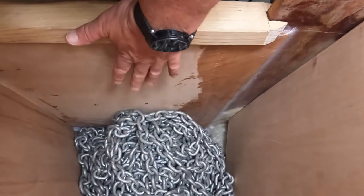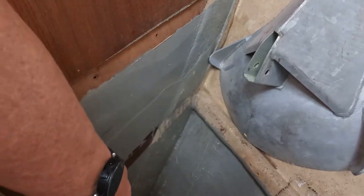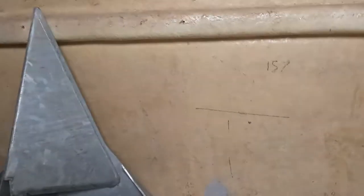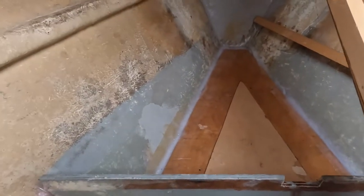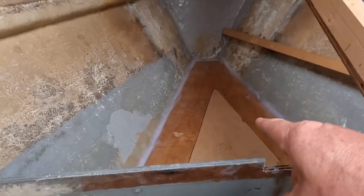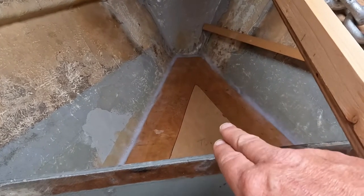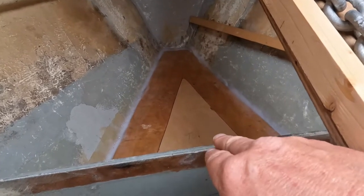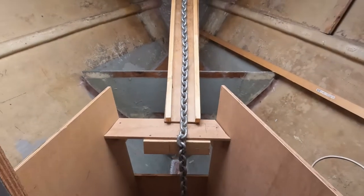This infill is now properly glassed in at the sides and bottom; it still needs fiberglass cloth in the middle. We've tabbed that original bulkhead in better than it used to be on both sides. This bulkhead is now glassed in, and the lid of that watertight compartment is glassed in. You can see the middle section, which is the one that lifts out, is resting on a lip which will get a rubber seal and will be able to be bolted down. Really happy with that remodeling.